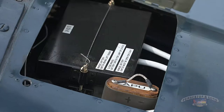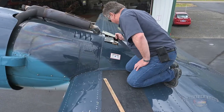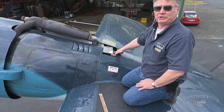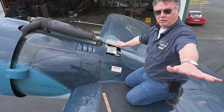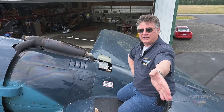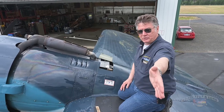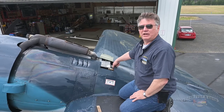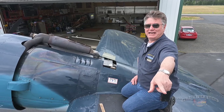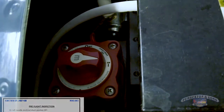I open this next door and right here I've got an APU plug if we've got a low battery. I can see my battery and all my solenoids — I just like to look around and make sure nothing's falling off. I've also got a port for a battery maintainer in wintertime. This airplane has two 12-volt batteries that run in series to give 24 volts. There's a 12-volt solenoid in the left nacelle that completes the connection between the two 12-volt batteries, and a 24-volt solenoid in the right nacelle. I've got a manual switch that can bypass the 12-volt solenoid to mechanically tie the two batteries together with 24 volts in the event of a dead battery.